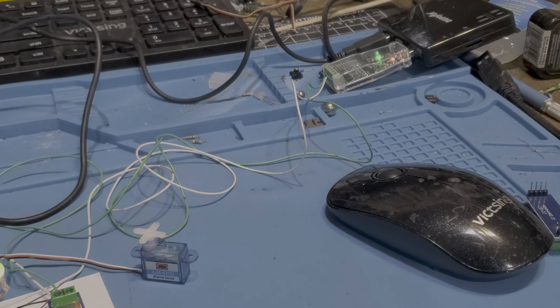If you get a bunch of RS-485 units on there, you might see a delay, but ordinarily, no, you won't, because the Arduinos are cycling so fast that even if you have 10 of them, it's not going to be a major difference, okay? Two wires out of here come into here. It's that simple. And we'll go through kind of the setup of that in JMRI also, okay?